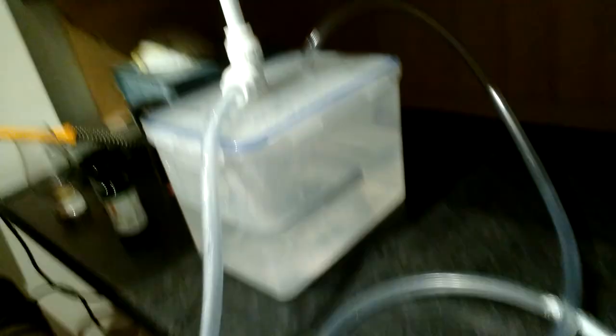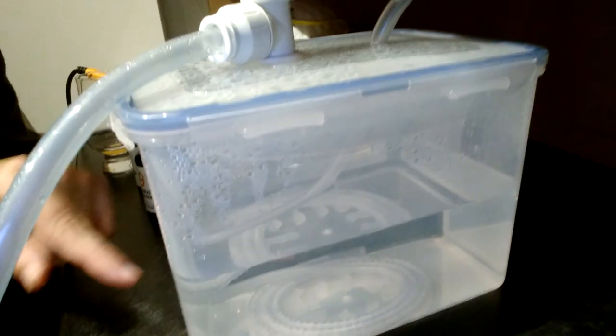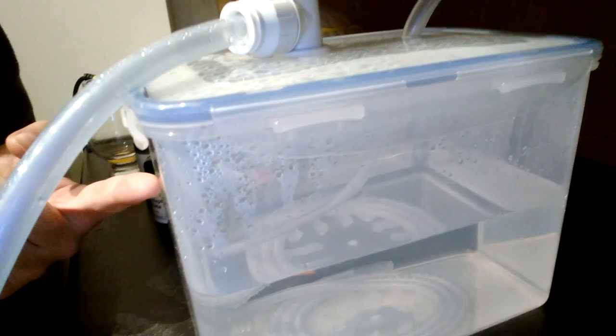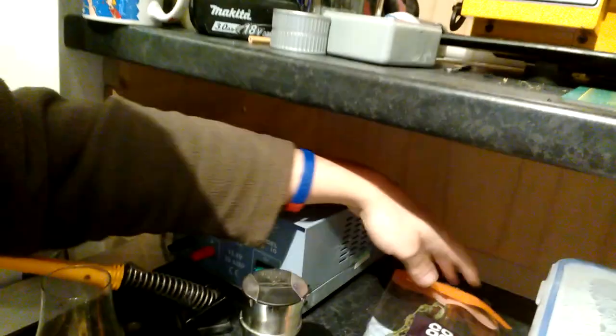Output from here goes into some poly tube which connects into a little spiral of slightly smaller tubing that has a load of holes pierced into it, so the air coming in under pressure can bubble up through the water, picking up vapour and any essential oils or medication you add to it. For example, I've got eucalyptus oil, tea tree oil, peppermint oil, clove oil, and thyme — all of which have favourable reviews online that you can read for yourself.